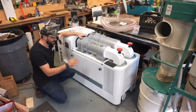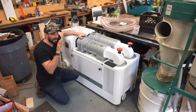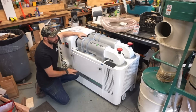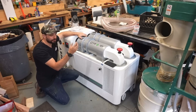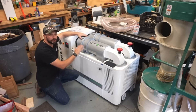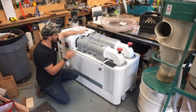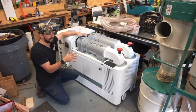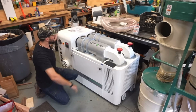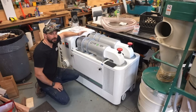This is the Harvey G700, a gyro-style dust collector. It's a very different design than the cyclone machine. The purpose of this design is to basically force your particles through the filter, so you're not relying on gravity to get lightweight particles to fall down into the bag. This is a 220 machine and it's considerably heavier — about 450 pounds. But it has some features that I really like, one of which is just the size of it. It's taking up a little more in the width, but it's low enough that I could put a bench top above it and utilize that space.